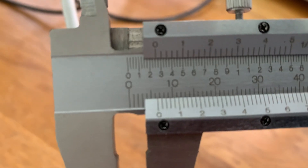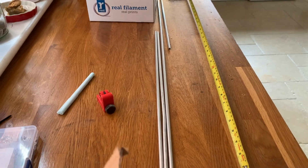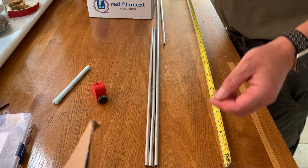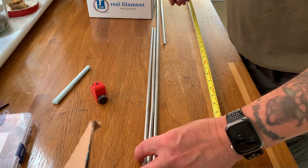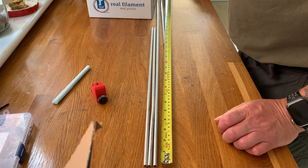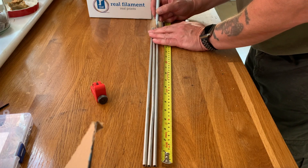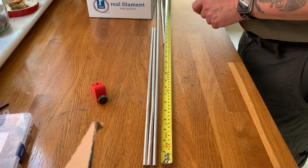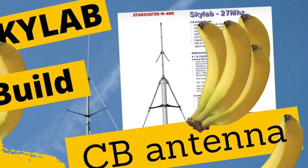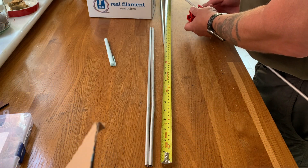The reason I'm cutting the tube is because I'm going to be building a two meter wide band antenna. That's the two meter band — 144 through to 146 MHz — and this antenna hopefully will work from 143 all the way through to 147 megahertz with a nicely low SWR throughout the entire band. This particular two meter antenna is going to be based on the Skylab. I'm building a two meter Skylab.